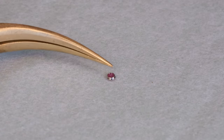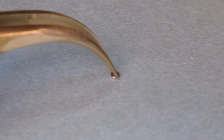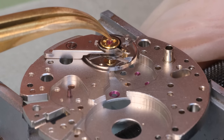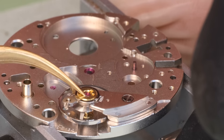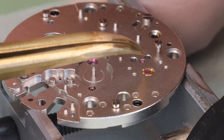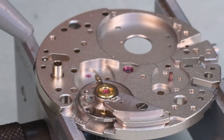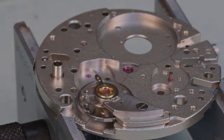We put a tiny little drop of thin oil into the center of the capstones to minimize friction when the pivots of the balance staff rotate back and forth. Friction is very important in watches — almost all the power from the mainspring is lost before it reaches the balance wheel, about 70 to 75 percent, most of which is due to friction. So when we can minimize friction, we do. Let's see if the balance oscillates freely — yes, that looks fine.